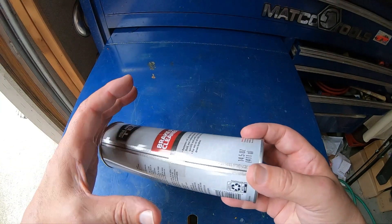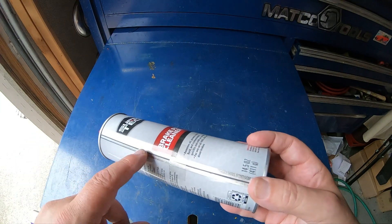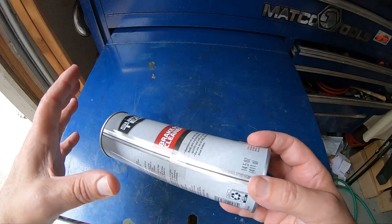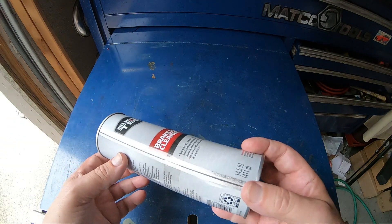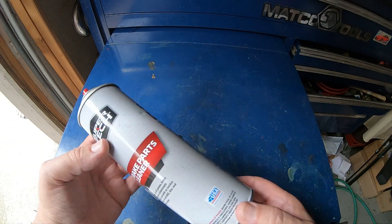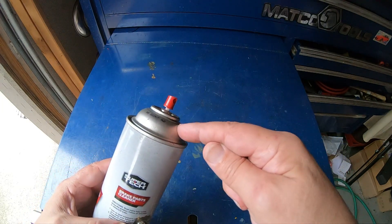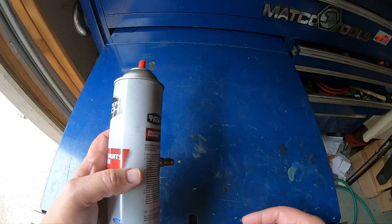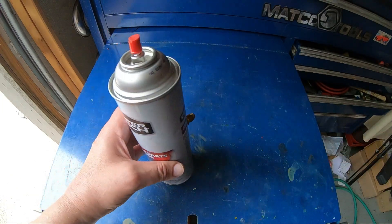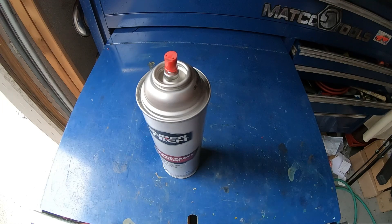It might split right here where it's welded, but the most interesting part is going to be seeing how much pressure it will hold before whatever part gives up. That's kind of the safety factor we're looking for — how much can you actually pressurize one of these if you're going to put a Schrader valve in it. We need to know what a safe pressure is. Anyway, let me get it set up and we're going to do this.